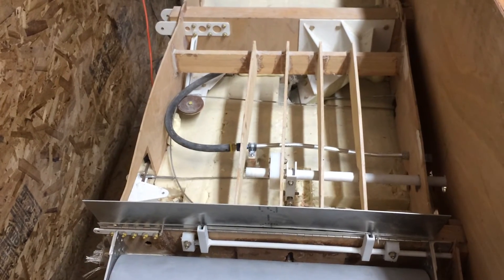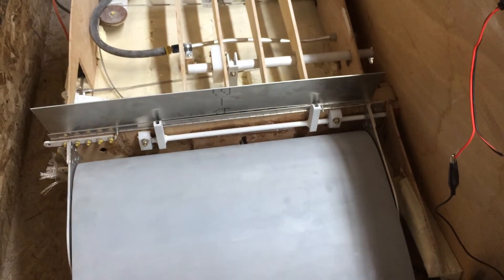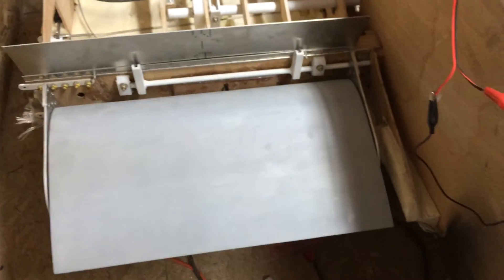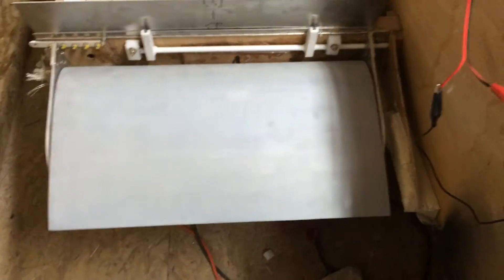The spoiler, by the way, is a piece of 4-inch by 22-inch .065 6061 aluminum with an aluminum hinge — all the brackets and all the actuators made out of aluminum and welded. When pushed through on the back of the aircraft, we had to do some beefing up because we drilled some holes in some places, but we just carried that through a torque tube all the way through the other side, and they worked out really nice.